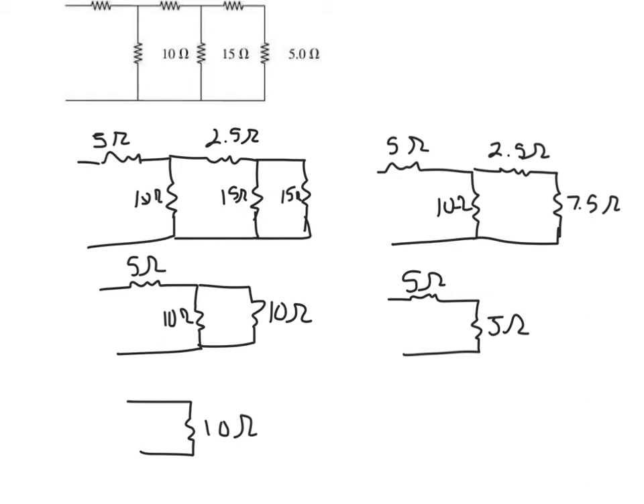Just to give you the idea of how this works — I started here: steps 1 and 2 combined the two in series; steps 3 and 4 combined the two in parallel into the 7.5-ohm resistor, because there was nothing between them. Then it was the same pattern: two in series combining for 10 ohms, two in parallel, two in series — left with the final result. The equivalent resistance of this entire circuit is 10 ohms.